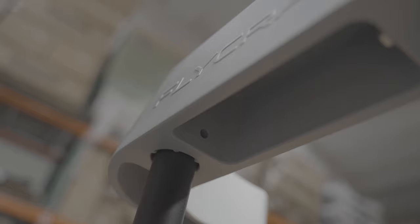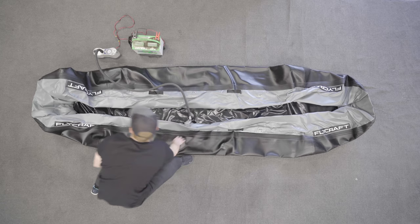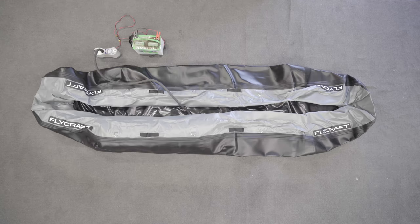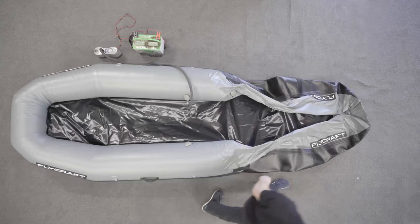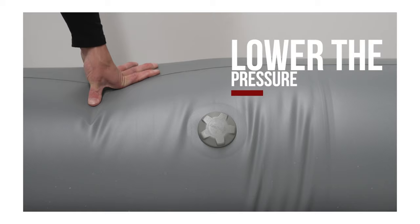Next up is inflating the raft. Open the valve covers, press the internal valve and rotate a quarter turn to the right — this allows air in but not out. A quarter turn to the left allows air to flow in and out freely. Have the valve turned to the right when inflating the raft. Keep in mind, the cap is not what keeps air in the valve; it is only to protect the valve mechanism from dirt. Inflate the raft tubes to 0.3 bar. Please watch our Boat Care with Brandon video for more information about air pressure and how to regulate it for temperature changes; we will link that video in the description.